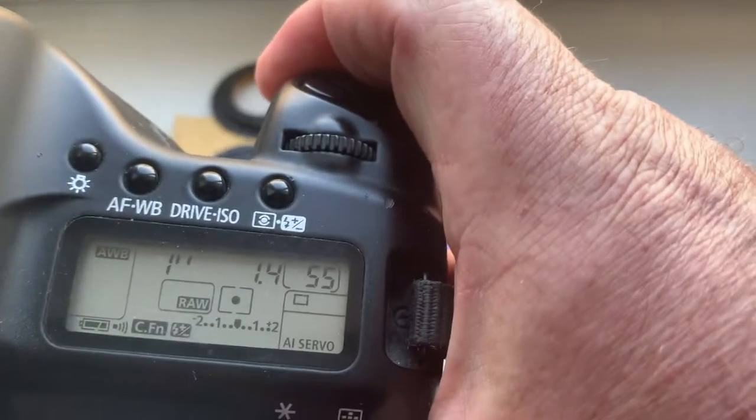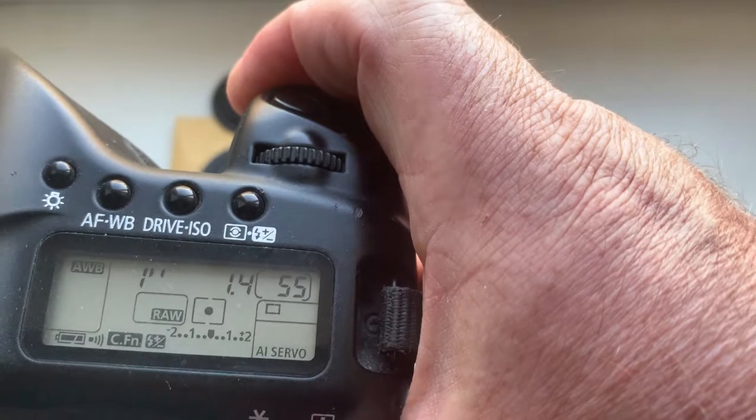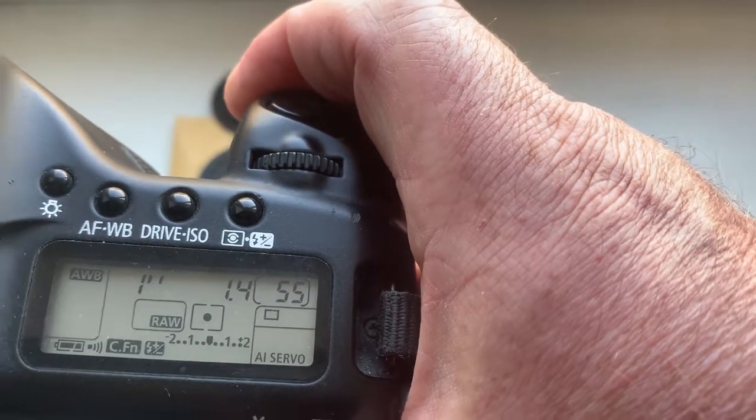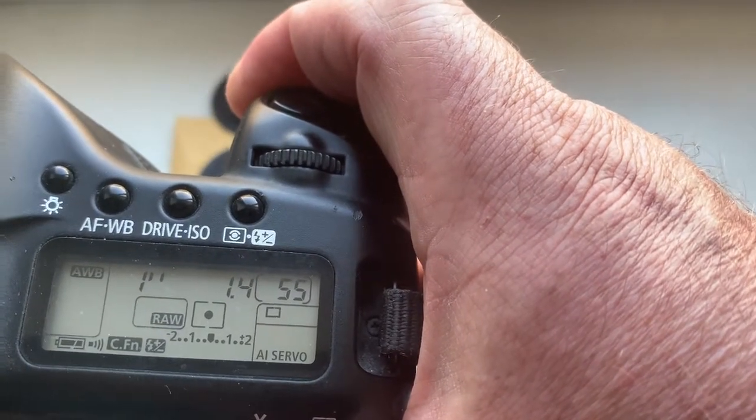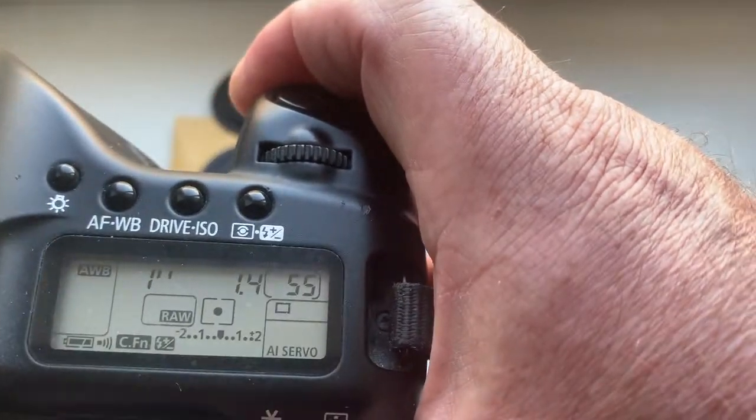This chip is pre-programmed with focal length 85 millimeter, aperture 1.4. The Canon camera does not have aperture 1.5, so I pre-programmed it as 1.4. Delay time to enter programmable mode is 1 second.